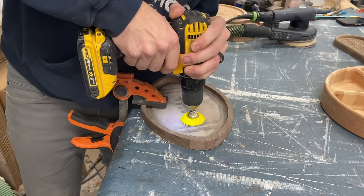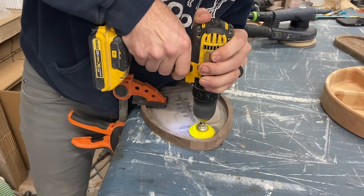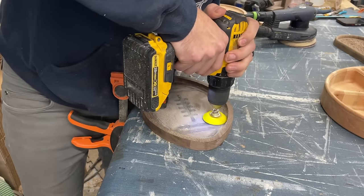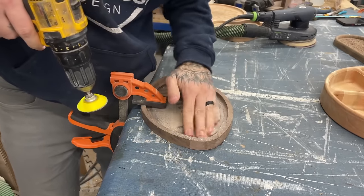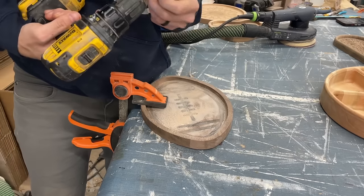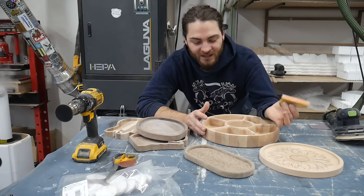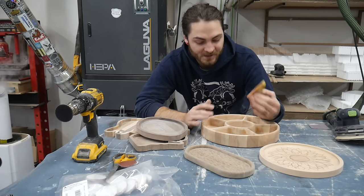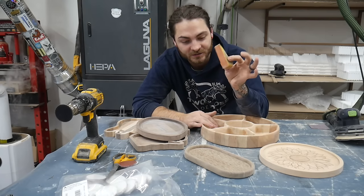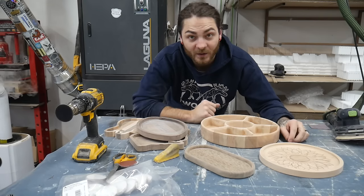The little drill attachment sander is alright, but I prefer oscillating head sanders — this thing kind of just flings dust everywhere. It's about $9 and does get into spots nicely, and with 80 grit on epoxy it knocked it down pretty quickly. Be careful though, as it's quite easy to make little low spots. You're also going to have to hand sand — there's just no way around it. Little tools like this gator zip thing work great for getting down into corners and crannies.